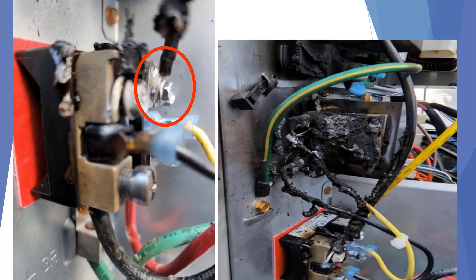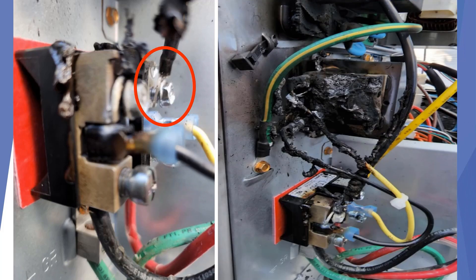The second example was on an inverter heat pump. You'll notice the screw that holds the wiring coming off the high voltage block is not even halfway into the block, so the wire was loose on this connection. When they put power to the unit, it smoked the terminal block and a couple of other components around it, and took out the wiring up to the filter board. This was on a brand new unit on a first startup. The homeowner was waiting for some cool air and had to wait an extra day while we got parts and extra wiring to repair the unit.